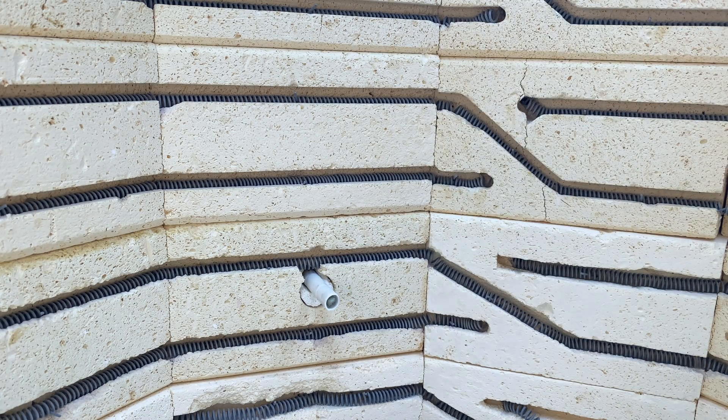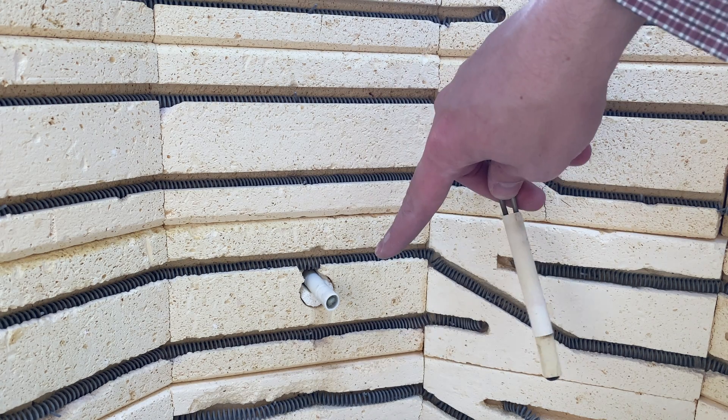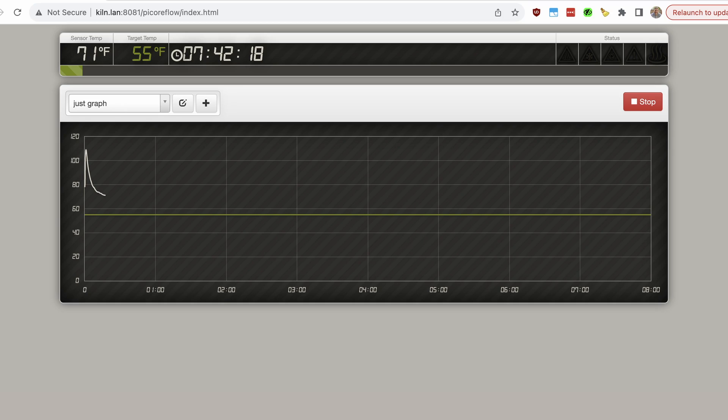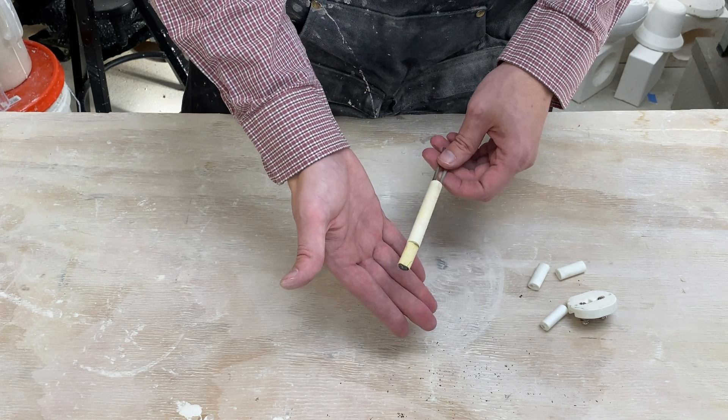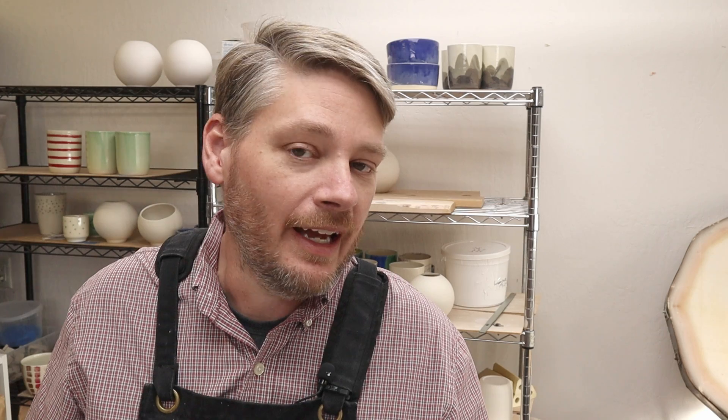Here's one more look at the new thermocouple, and in comparison the original — hopefully this one will serve me well. The temperature on the graph has dropped back down — you can see the white line jumped up and then decayed back. I'm going to hold on to the old one just in case, as a backup. For the first few firings I'm going to pay very close attention to my cones and make sure they match up to what the graph is doing. With that, I can go ahead and make some more pots and do some more firings. If this doesn't work out I'll add a note to the description. If you have any questions or comments, let me know — thanks.